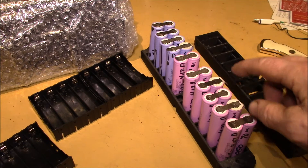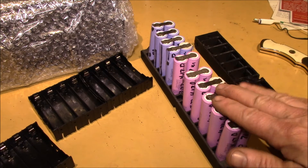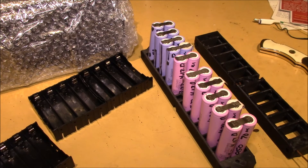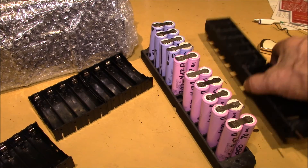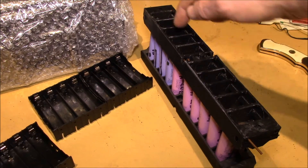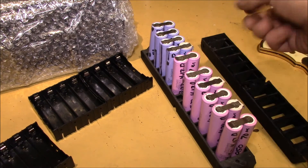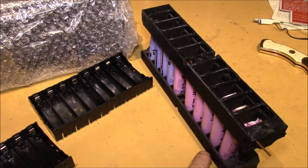But that's quite a bit of work. If you find out even after you've tested all these cells that one or two of them don't stand up to a couple of cycles of charging and discharging, or the capacity doesn't check out, it's a lot of work — you've got to cut 10 fuse wires, cut the jumper wires on the bottom, take it apart, change the cell, then solder jumper wires on the bottom and 10 on the top.